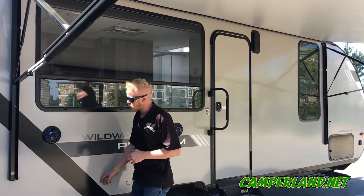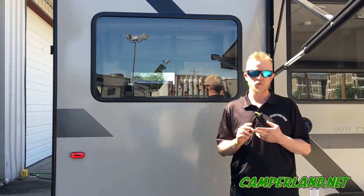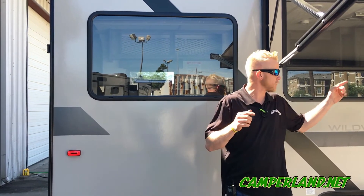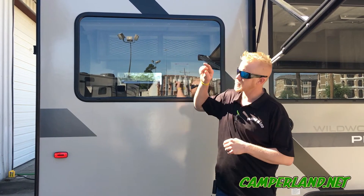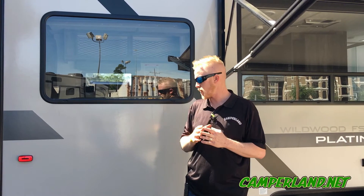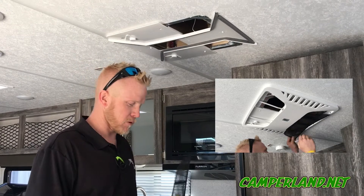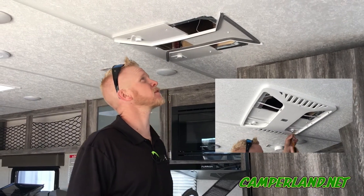Make sure nothing is gapped open. The four biggest leak points are your front and rear corners, especially at the top of the roofline. You want to make sure those are definitely void-free — those are the major leak areas on all RVs.